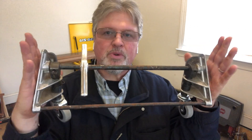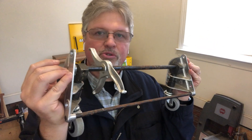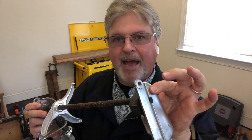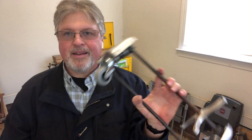So now we're not just relying on the legs to hold these in place — that screw is there. A screw needs to be able to rotate a little bit, and because of that, you get in situations where that screw can begin to back out. So I need to put some Loctite on the threads and drive that in, but not drive it in so tight that it's clamping against that. Still, cool piece of engineering. Around that time, these were shipped over to Taiwan, and that also introduced a few quality issues.